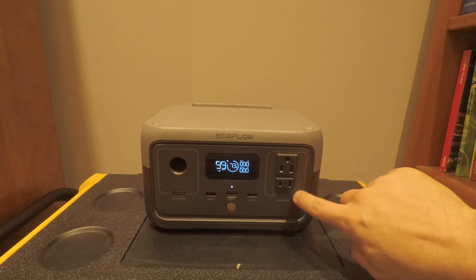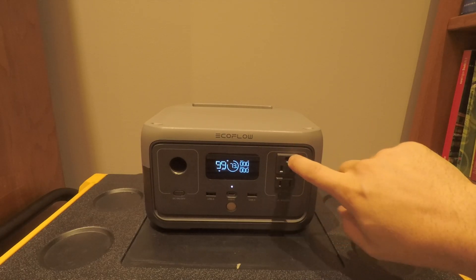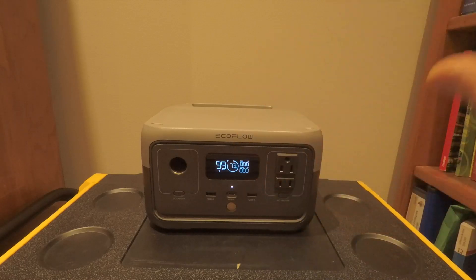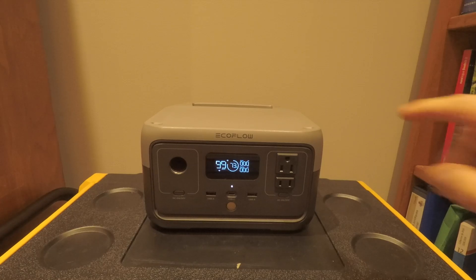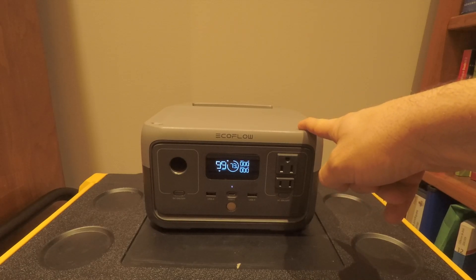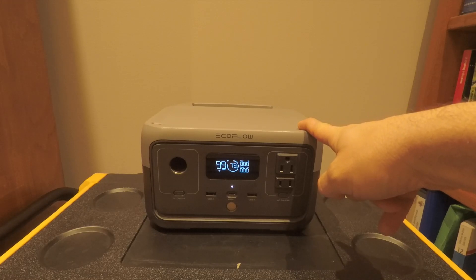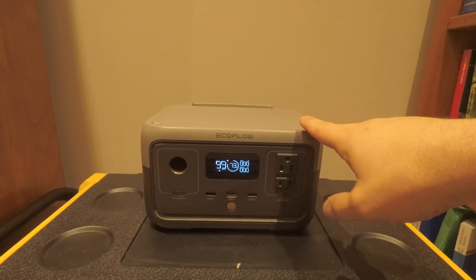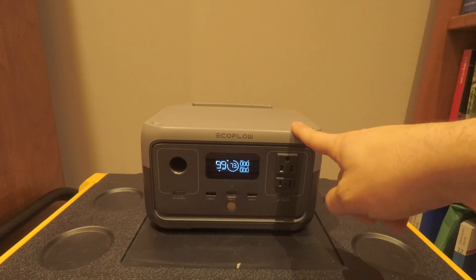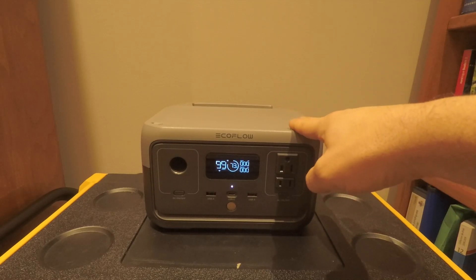This is advertised to have a 300-watt inverter — I'll explain that more later, and it's nothing to do with X Boost. Next, this is a new chemistry design: it uses LiFePO4 chemistry, so you can get up to 3,000 cycles before you lose only the top 20% of battery capacity. There are also strategies to extend it further than 3,000 cycles, so if you do this right it could last a very long time.